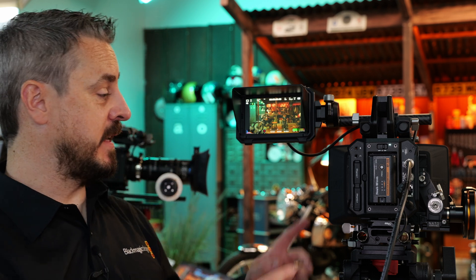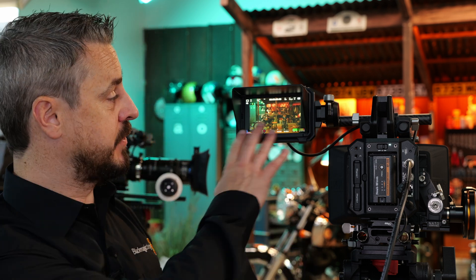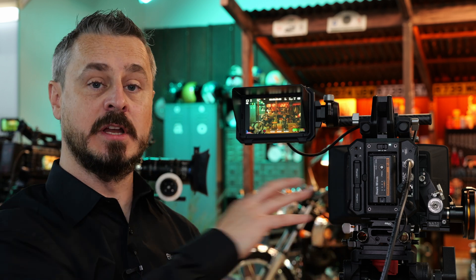The USB cable can be up to five meters and gives us control through the touchscreen and all the menu systems of the camera. So if you've got a camera position that's further away, or you're using it on a crane for example, you can still use the Pixus monitor for your view of the camera's position and as a remote control for all camera features. The menu system is exactly the same as found on the camera — it's an extension of the camera's own side monitor to a portable and remote system, giving you full access, full viewing of camera status, and full control at a distance.